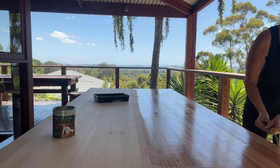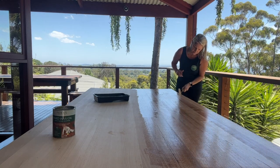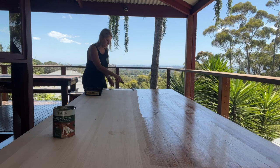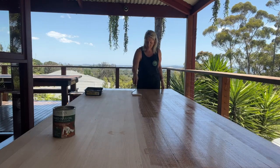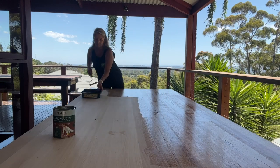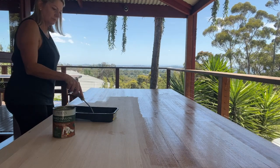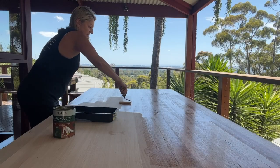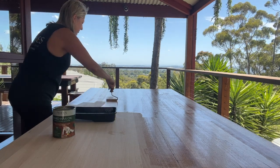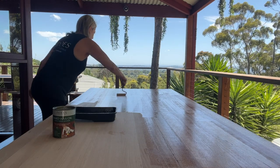You can see by the way I'm holding it — very gentle, not digging down. You could use a brush, but why would you bother on a piece like this? Maybe something smaller or more intricate you'd use a brush, but there's definitely no need in this situation. A roller is much faster. This is the silk sheen level — silk is about halfway between matte and satin, so if you don't like the flatness of matte or the shininess of satin, silk is a perfect option.